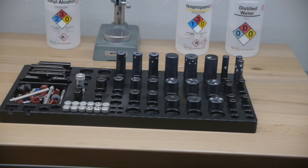Before ordering the plate, make sure to choose the thread size that you want to go with — choose a thread size that matches the size of parts that you plan to inspect. Tiny parts will require something small, like M4 threads, while larger parts will require something large, like M8. Or maybe you just want to use the same thread size throughout the entire lab — if that's the case, just pick one size and stick to that. After your plates are selected, choose a kit to go with. I would recommend going with one kit for each machine, that way you aren't wandering all over the lab and stealing fixturing from other kits. It may be tempting to cheap out and get a minimal kit to get started, but you will quickly learn that you will need more pieces. One additional point is that some fixturing companies sell fixture building software, which is useful if you are using CMMs and OMMs that have collision avoidance features built in that automatically generate collision-free paths for your program. Importing a CAD model of your part already assembled to a fixture will make your life much easier when using these types of programming applications.